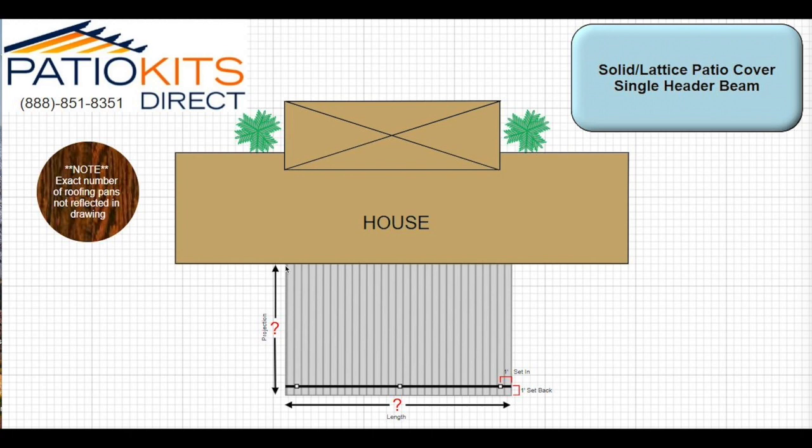The projection is either from the wall or from the fascia. That's important because fascias stick out anywhere from 12 to 18 inches depending on the home — that would be your starting point where you want to measure to your projection, the total shade. If it's a stucco wall, maybe on a two-story house, you'll go straight to the stucco and measure outward. The standard overhang is one foot, though some people choose 18 inches or even two feet. You would need to let us know if you want a larger cover than your concrete area. Projection is the first number.